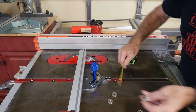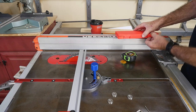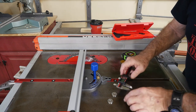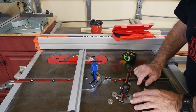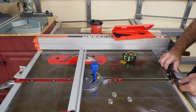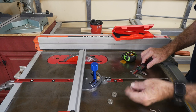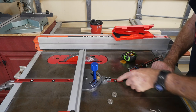I'm going to measure one of these — I'll go with 7/8ths of an inch, and let's do metric too. 22 millimeters on the nose. And the actual slot opening for my Craftsman here is 23 millimeters. So there's plenty of slop in here for these wheels, but the problem is when they pick it up this way, it hits the top of the T-slot and causes the gauge to bind.